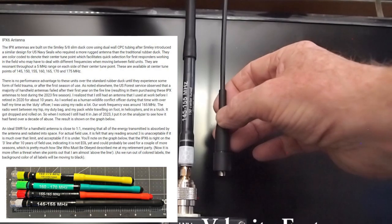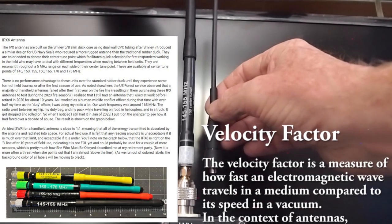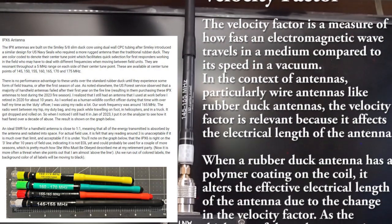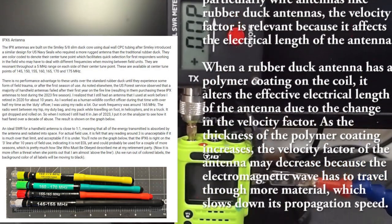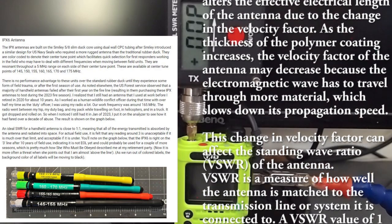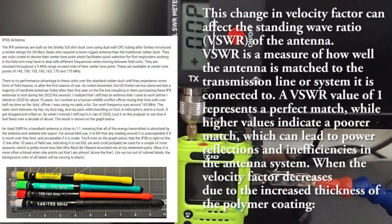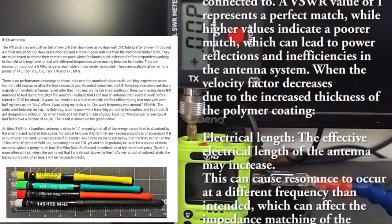The stock antenna here in my hand — you can see quite a difference in thickness between the two antennas — and what that translates to is the velocity factor, which will affect the forward power and the standing wave. The tuned antenna is thicker due to dual wall heat shrink, and as a result these antennas have to be tuned to adjust for velocity factor.